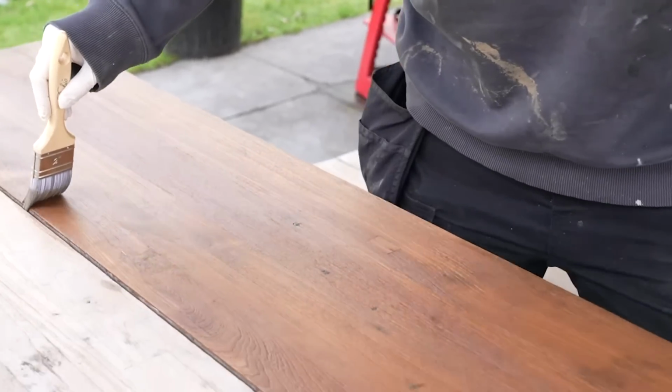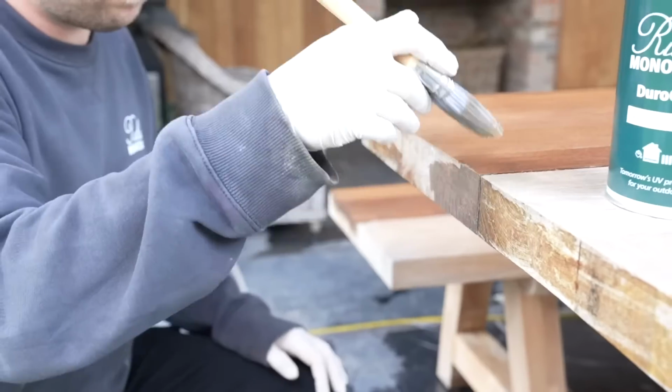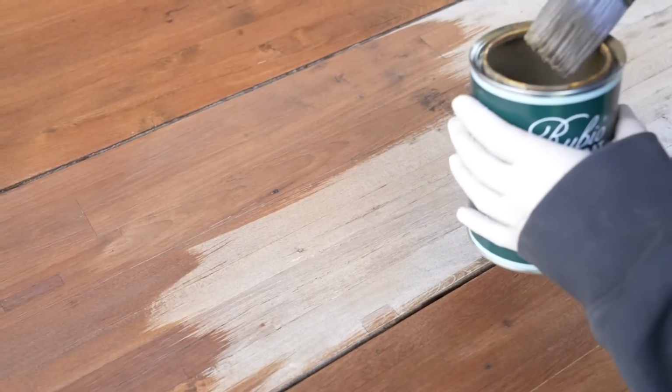Once the product is spread out, smooth that section again with the same brush without applying new product. Do this to avoid start, stop, and brush marks. Keep in mind not to put too much pressure on the brush while doing this.